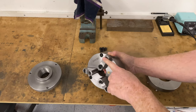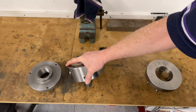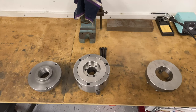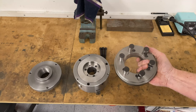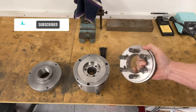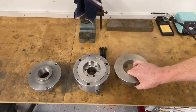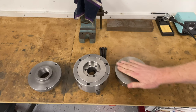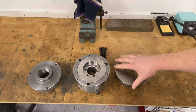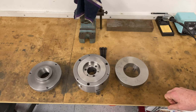I have to re-grind the outside jaws if I'm going to use those. I want to use this chuck on the new lathe, which requires the manufacture of an appropriate backplate. I've procured this one - a nice hefty item, actually a South Bend brand - and I've just spent the last week cleaning the Cosmoline off it. It was caked in it, which is just a matter of soaking it in WD-40. And now it's a matter of turning the face to fit. So that's what we're up to today.